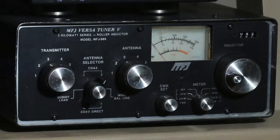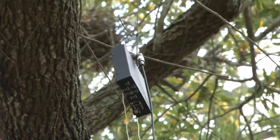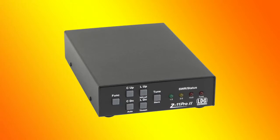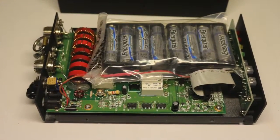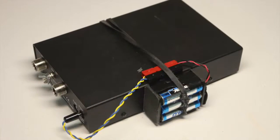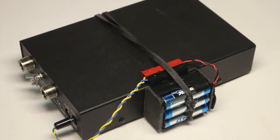With the BAT, you can put the tuner right where it belongs, even 30 or more feet in the air. The best tuner for this purpose is the LDG Z11 Pro 2, which will handle 100 watts. With its latching relays and AA battery power, it will tune antennas for many months or even a year or more. I will be using the one that has the internal batteries; however, you can just attach them on the outside with a rubber band.